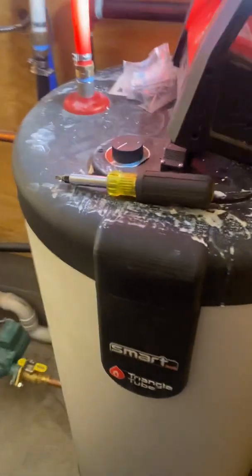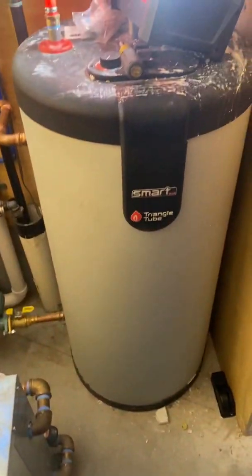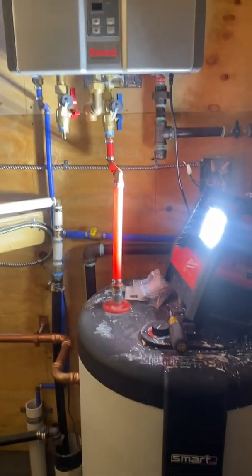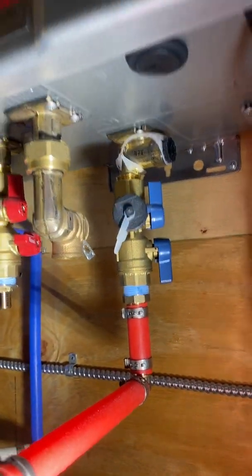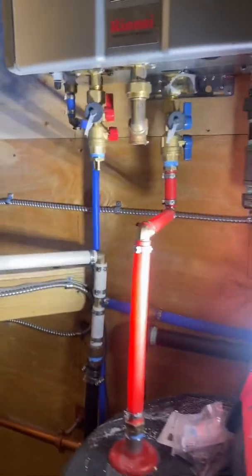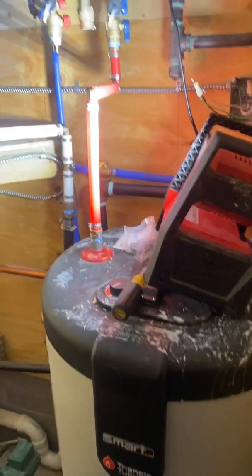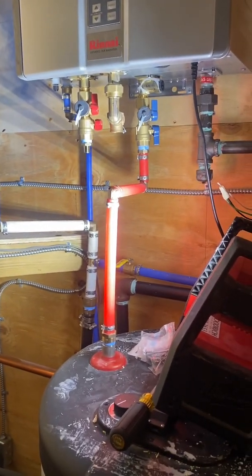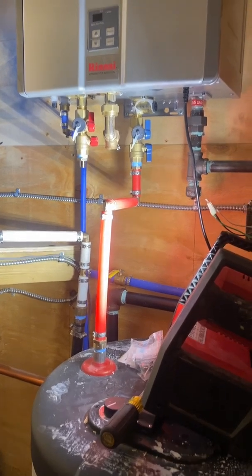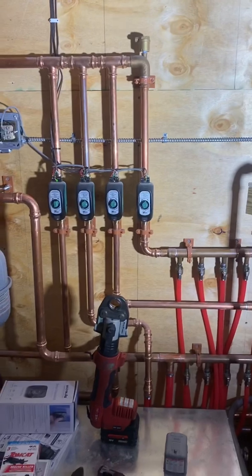There is a thermostat on this indirect water tank but it's not hooked up to anything right now — I basically get all the heat I can out of the heat pump while it's running to preheat that water before it feeds into the Rinnai. I've already got it piped into the cold water inlet on the Rinnai. This particular customer had a concern about running out of hot water, so putting the Rinnai downstream of the preheater tank guarantees they'll never run out. Whatever we preheat with the heat pump is definitely going to save on propane consumption for the Rinnai — that's still a big savings with the geothermal preheating.